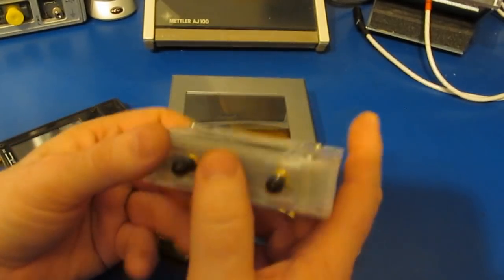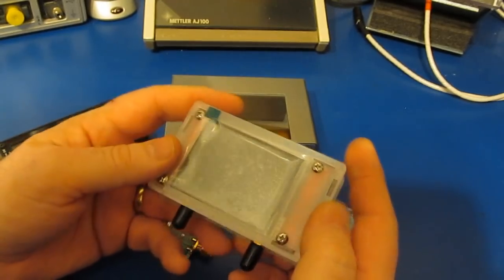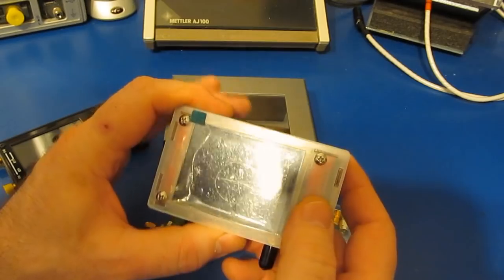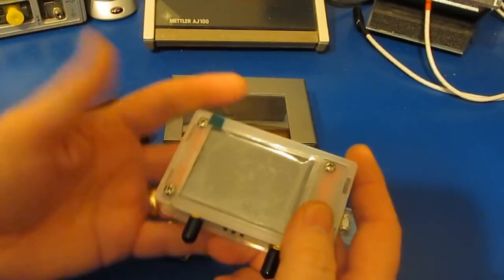Originally I thought that the problem was tied to the amount of data that I was bringing down. It appeared that the chance that it would lock up would increase based on the amount of data that I would send across the port. So it seemed more reliable at 100 data points, for example, than 400 data points. The more I ran into the problem though, I don't believe that has anything to do with it.